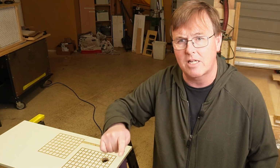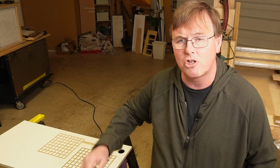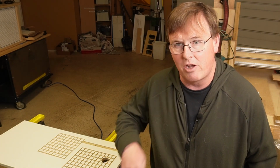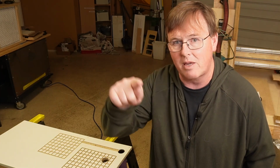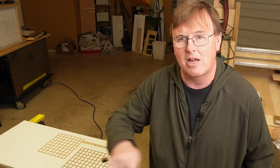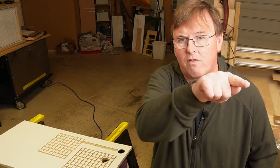And if you tune into my next video, if you are a V-carve user, I will show you how to set that up. It will reduce your machining time down by about 50 to 70% over doing little squares along the way. You don't really want to do your tool pass that way. You want it one continuous poly line, go all the way around your grid, and then come around, keeping the same continuous poly line all the way over, and then hit stop on your polyline tool.